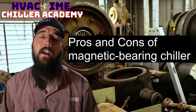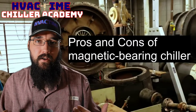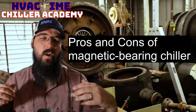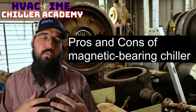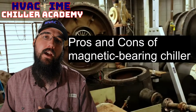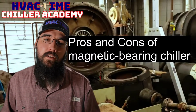I mean, it does not take long. I get pictures sent to me all the time where the whole suction cover of the compressor is just full of oil, and you pull that front cover off and oil starts to drain out the front of the compressor. That can't happen. And so that's a practice that we haven't properly adopted when we start working on these machines. We cannot have oil contaminated cylinders of any kind. That is a major thing we have to take into account, and it is causing a lot of failures, more than just some of the natural failures that are happening on their own. So, anyway, there's your pros and cons to mag bearing.